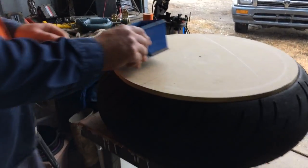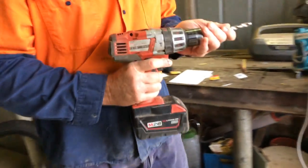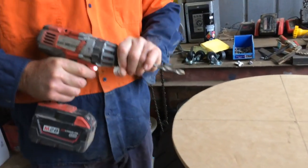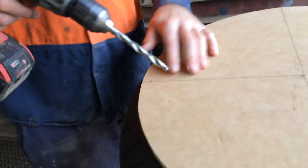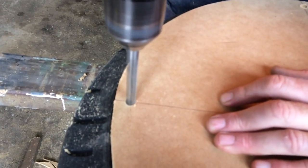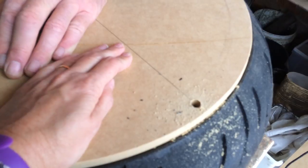Today I'm just going to use whatever bolts you've got. These are 8mm bolts. I'm going to use an 8mm bolt, so I'll put probably a 9 to 10mm drill bit through — just gives you a bit of clearance so you're not trying to force something through. You can just drill through enough to mark the holes. They're drilling pretty easy, so you can smell the rubber burning.